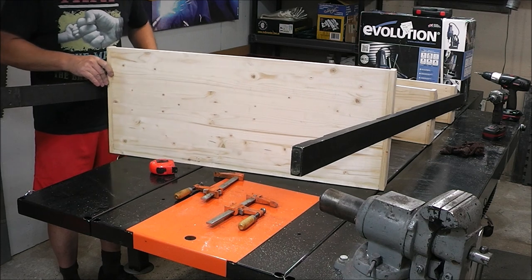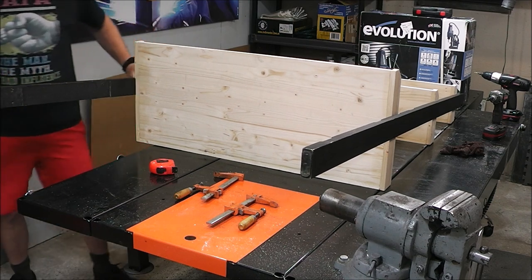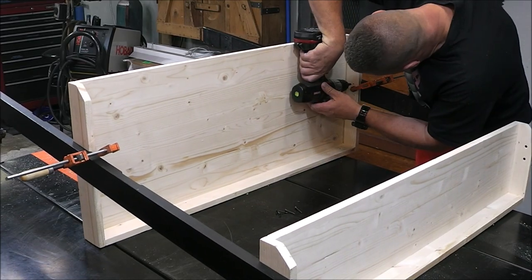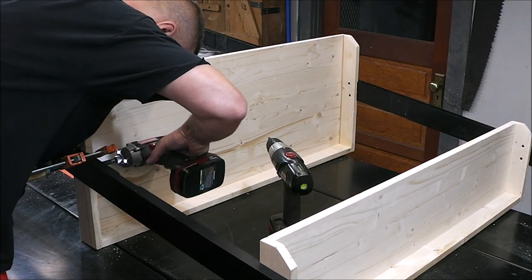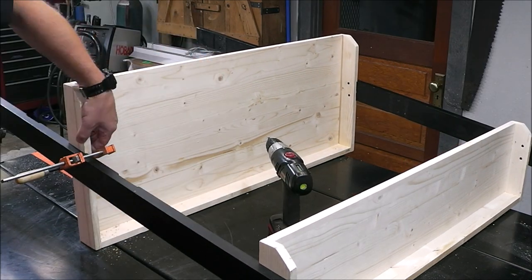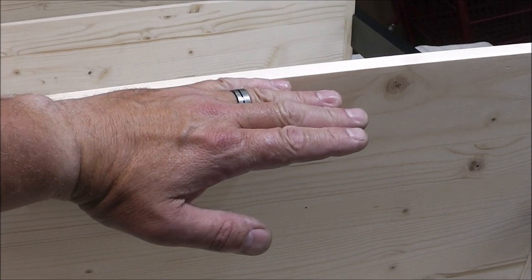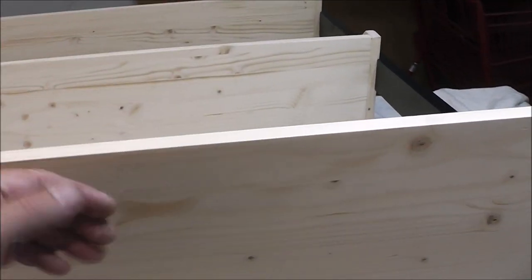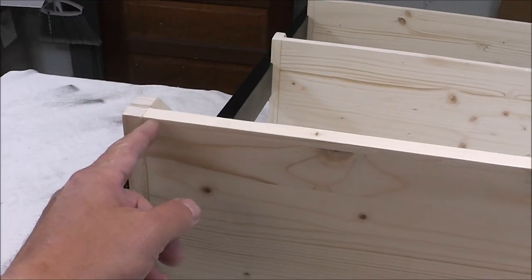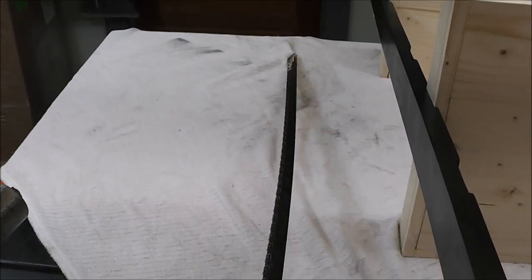I'll put a little wood putty on it. So I'll put that in that notch and this goes in this notch. What a nice tight fit. It's got an eight-inch wide shelf — it's going to fold down flat like a drop leaf table. In the use position it's going to go up like this and you'll have a pin to pull out to hold it in place. The continuous hinge is going to go from approximately here to here, so I've marked it out and I'm going to bring it over to my metal cutting saw and cut it.